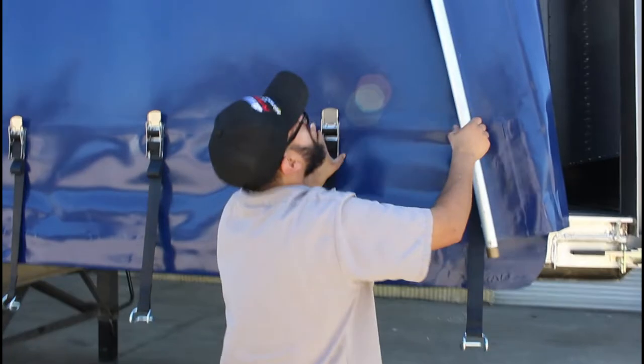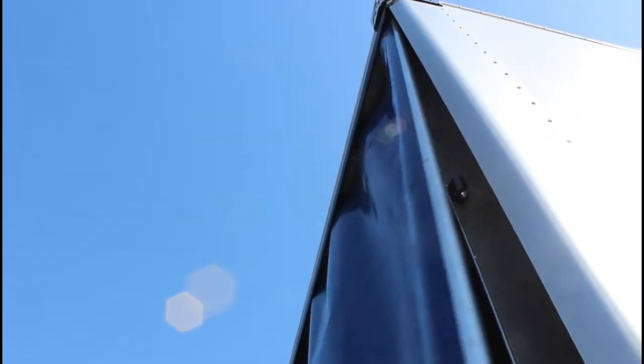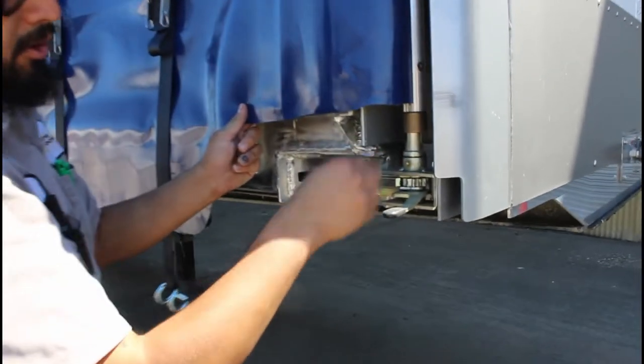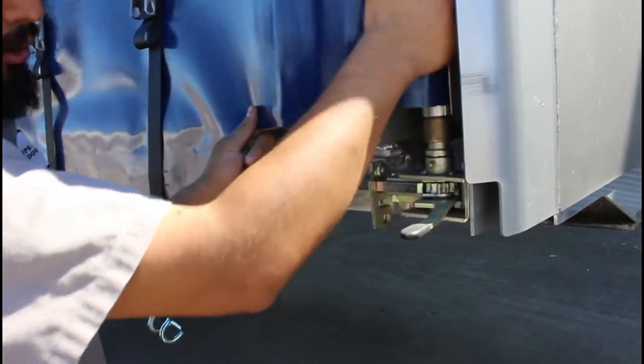Make sure we get the curtain itself under the pallet at the top. On the top there's a yellow cone — that's where you want to get the top of your pulling. Get your fabric between the post and the pallet, get your pull inside of that cone, insert it, and then drop it down at the tensioner. Just rotate it until it drops.